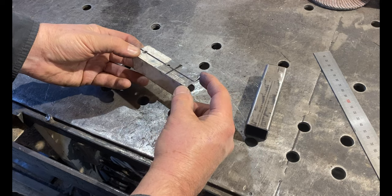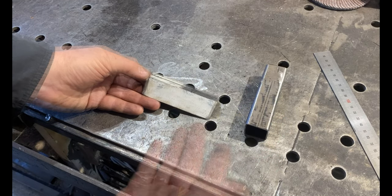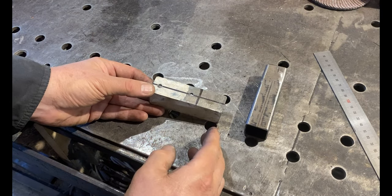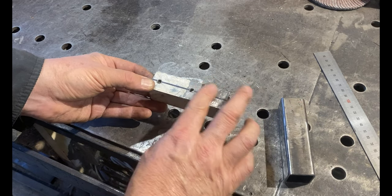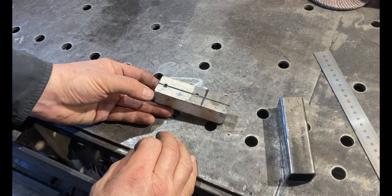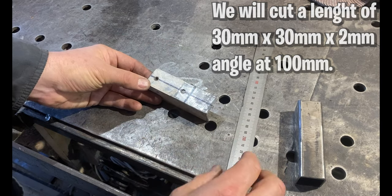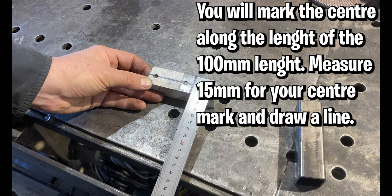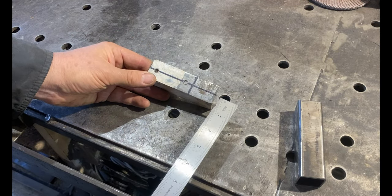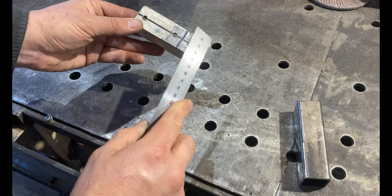We're going to use some of our 30x30x2mm angle. First thing to do is get this angle all clean — mine is already painted, so I've roughed it all back and cleaned the end where I need to weld completely back to metal. You'll more than likely have new angle with mill scale all over it, so get it all cleaned up first. Once it's cleaned up, you will cut a length of 100mm. Find the centre — it's 30x30, so your centre is 15mm. Measure 15mm at one end, make a mark; measure 15mm at the other end, make a mark; put your ruler on and draw a line to get the centre. From one end, you will measure in 35mm, make a mark, put your square on, draw a line — this is the area we'll place our box.